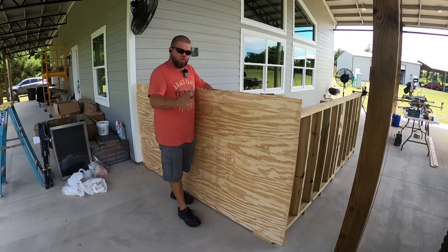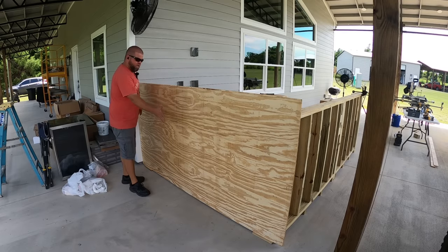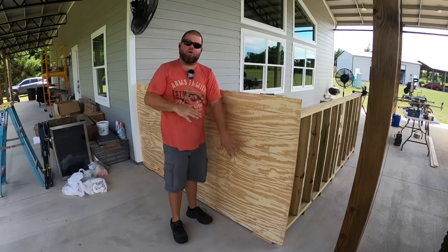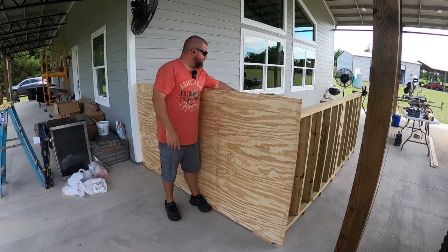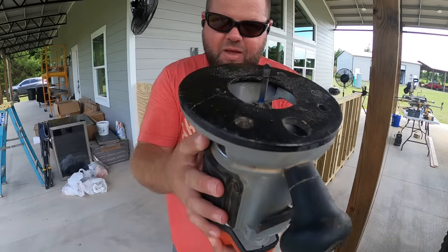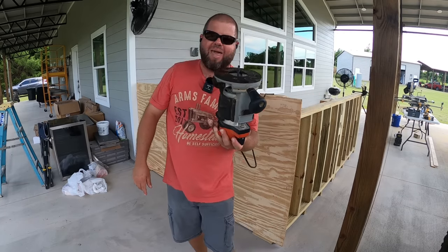One thing worth mentioning with paneling — especially thin paneling like this — it tends to want to warp and bow on you. So I always start on one end and try to work down the paneling, which works the bow out. If you just go nailing blindly all around the edges, next thing you know you have paneling bowed out like this. What I'm going to do is go ahead and trim my paneling out. To trim it I have this panel bit — it's got a tip on the end that'll drive right through this stuff if you need to cut out a window or an opening, and it's got a cutting blade right on the very edge.